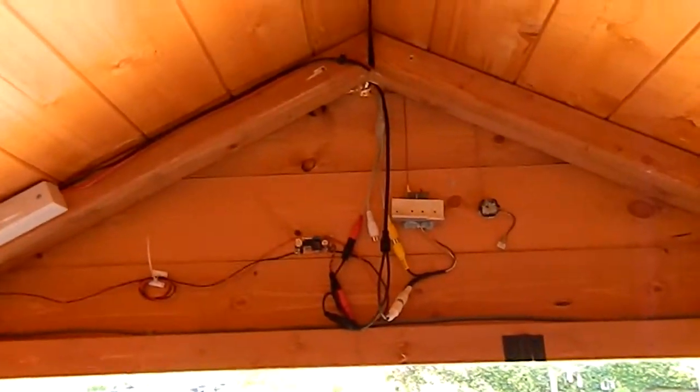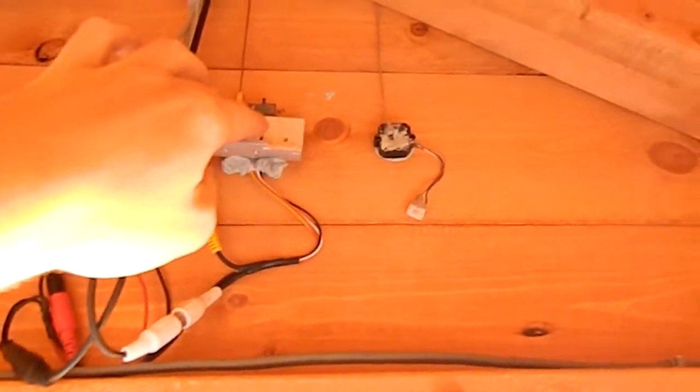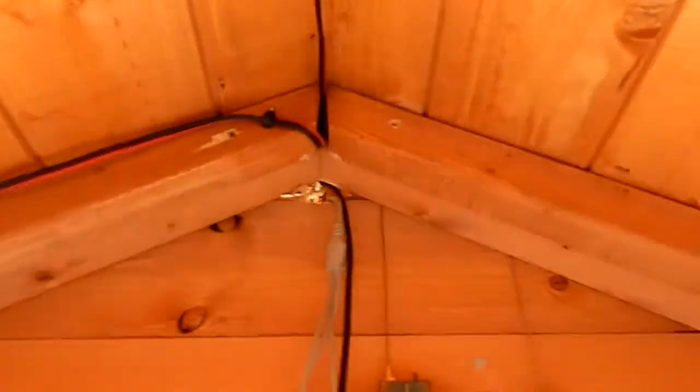The final thing is there's a wireless transmitter there — that's the old one, and that's the one I use now. It runs on 1080 megahertz and transmits into the house. The camera's on the front there. I've also got a separate microphone which is really sensitive and provides really good sound — the picture you get is really clear. That regulates the voltage to the transmitter to 11 volts, because if you run it at its rated 12 volts it does get quite hot. I've just stuck a piece of aluminum on the front of it as a heat sink.